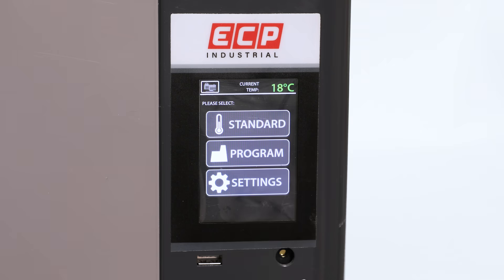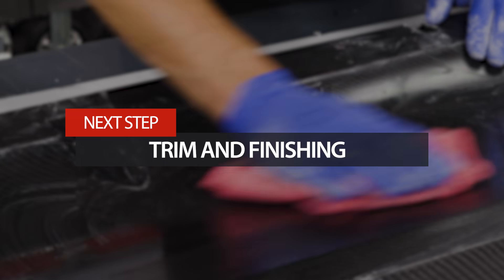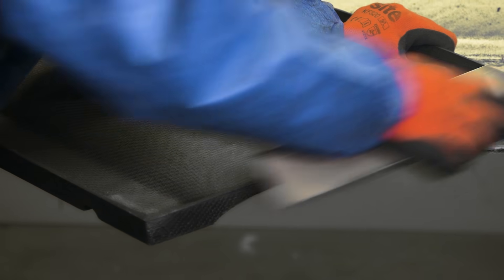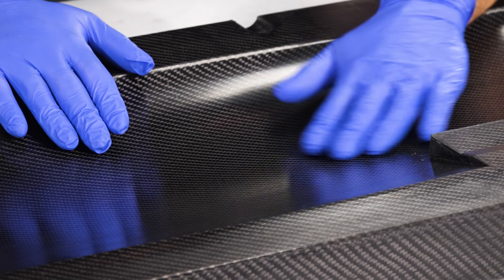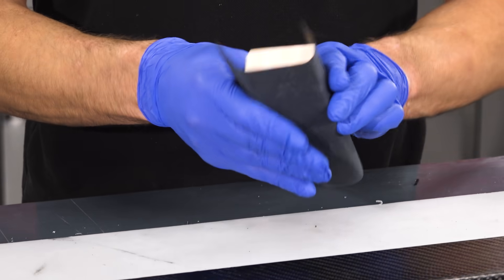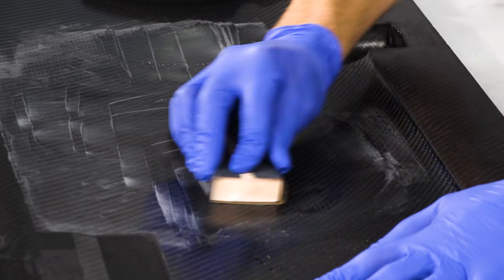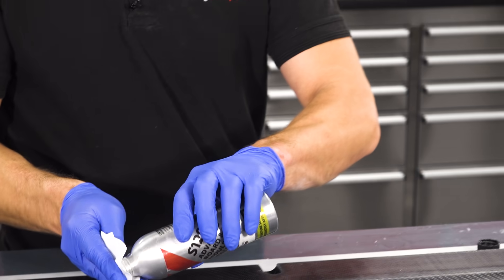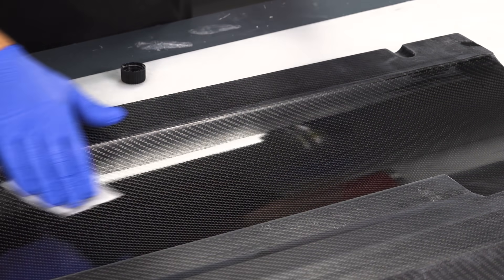I'm loading the mould into an oven and conducting the post cure — in this case a slow ramp up to 140 degrees C. Once the post cure is complete, the flanges can be trimmed and sanded flat and smooth. With the mould trimmed up, we could put this straight into service with some release agent. But looking closely, there is a very slight texture in the surface of the mould left from the model board, so I'm going to flat it down with 1200 grit wet and dry and then restore the gloss with some S120 sealer. The very slight texture from remaining porosity in the model board is in the positive once in the mould, so flatting these out is a very quick process. After sanding, the mould gets cleaned with mould cleaner and then two coats of S120 sealer are applied. To get a good even film, you need to wipe it in a linear pattern and not double back until it is cured.